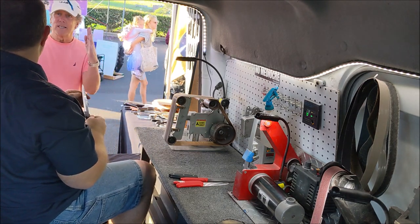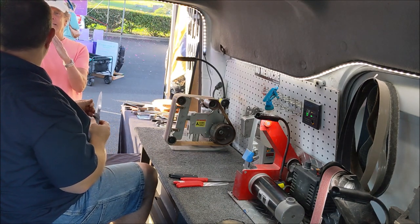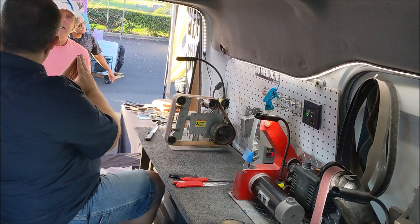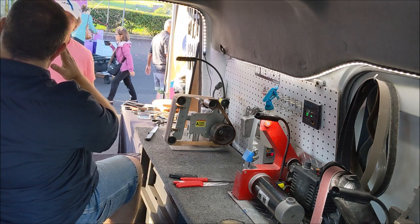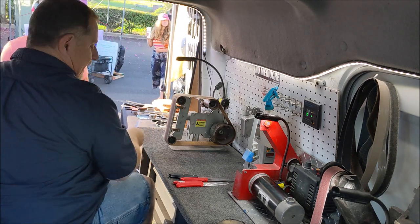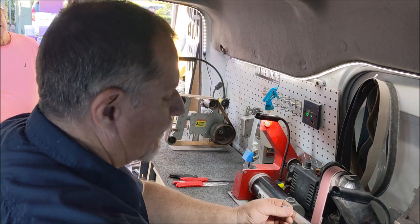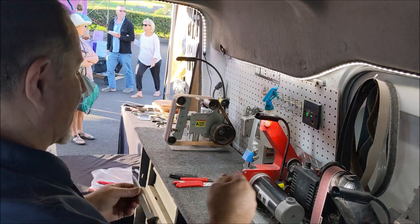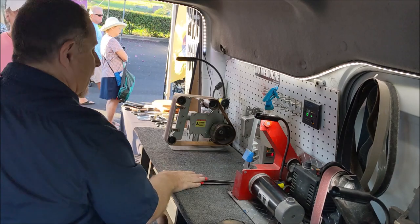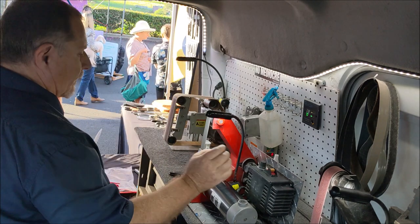Okay, and how do you get it? Angle guides. Okay, but like this instead of like that, is just feel? Well, you can see that when the angles are equal on both sides. If you're grinding all on one side, the bevel will get small on the other, so you keep it in the center. And the angle guide actually allows it to be... I can see because of the lighting when the two surfaces come together, then you stop before you remove any extra material. And then the second step has the same angle, only it's a tenth of a degree different.